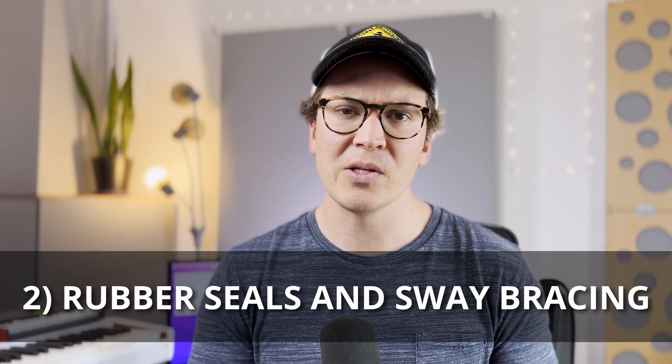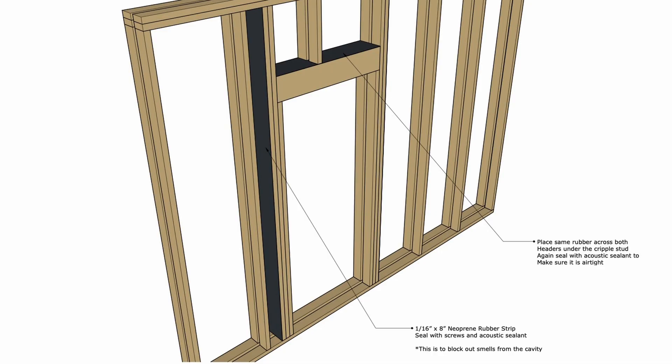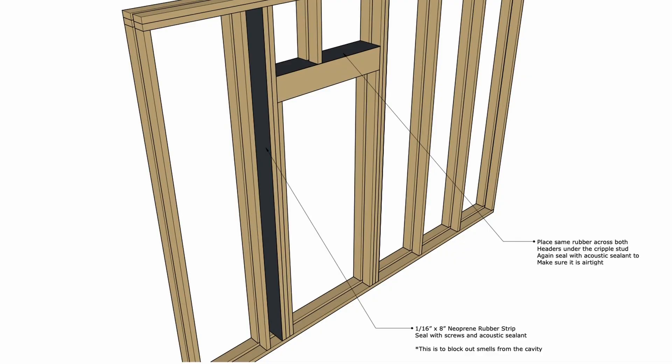Number two, we're going to talk about rubber seals. This is an idea that I actually learned from J.H. Brandt, who's another studio designer and acoustician that I really respect in the field. He has recommended using rubber along the gap between your one-inch air gap right there in the walls. In this diagram, I'm actually going to put the rubber on the outside of my king studs rather than the inside of my jack studs. The reason for that is that I'm now looking into using pre-finished steel door frames, which makes it easier to install the framing of the door — those frames actually wrap around the finished wall. We want to seal it with acoustic sealant and then you can pop it in with some wood screws.